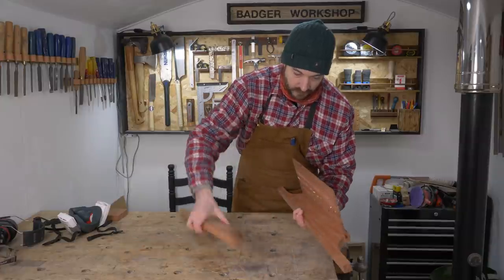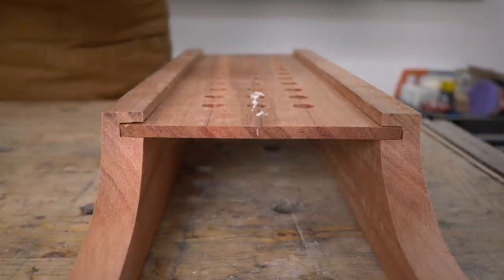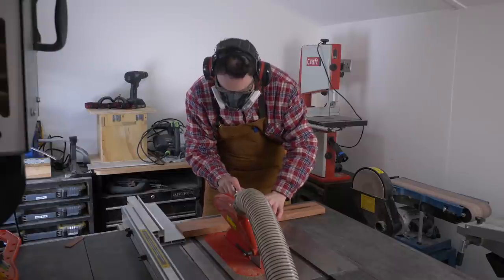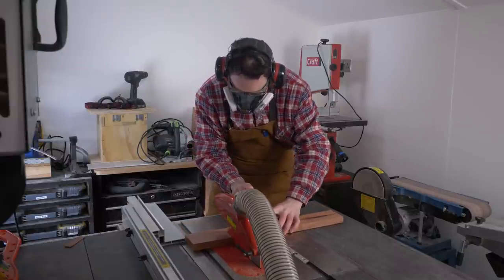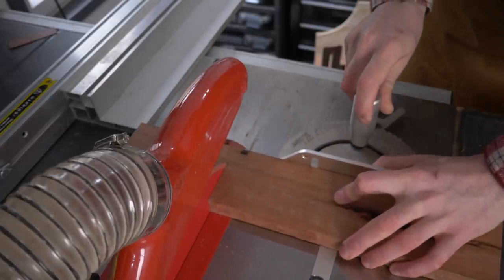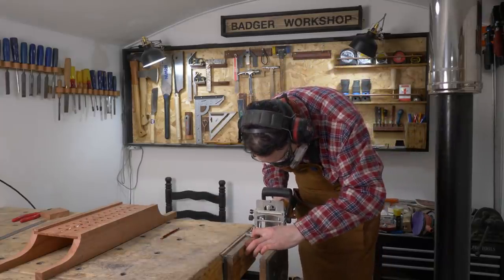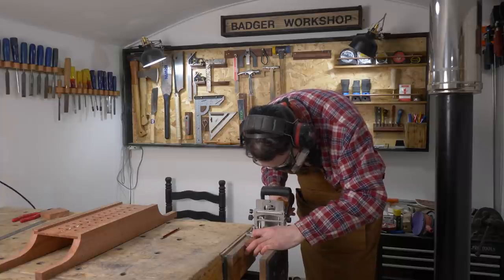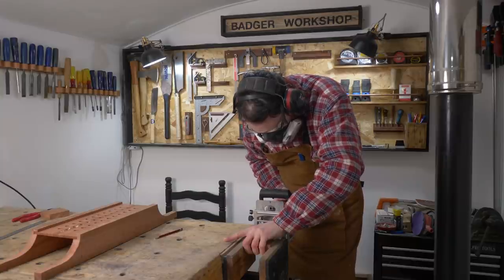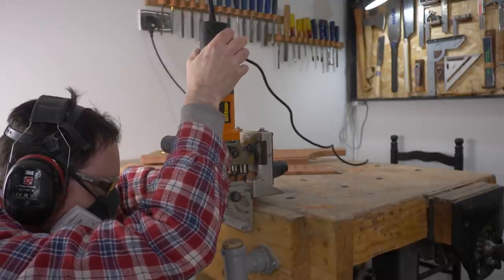Now this is going to need a couple of pieces at each end to join it together. First I have a little dry fit and then I can measure the span to work out how big those pieces need to be, then go back over to the table saw and get them cut. To join them together I am going to use my Triton dowelling machine, but any dowel jig would work, or even some screws and a plug cutting bit would work well. These are 8mm holes and I am using 40mm long dowels.